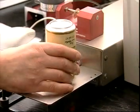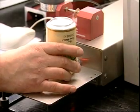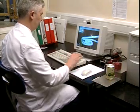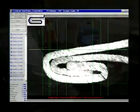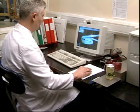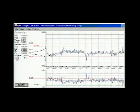The can should be placed on the projector and positioned to give the sharpest possible image for measurement. The section appearing on the screen will now include measurement lines. These should be checked for positional accuracy and manually repositioned as necessary. The results can then normally be automatically recorded. Any out-of-specification results will be highlighted, showing corrective action may be necessary.